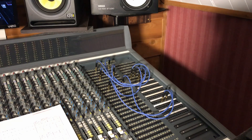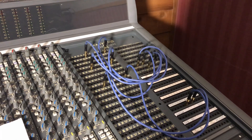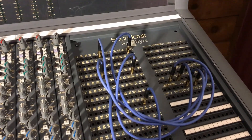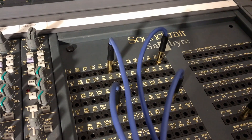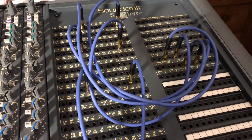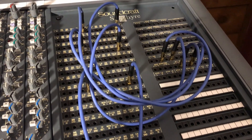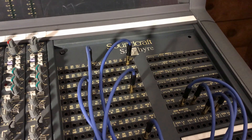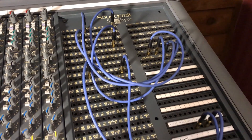A key part of what makes it easy to do videos and bypass all other equipment — to give an honest representation of what a particular piece of gear sounds like — is this patch bay. I have the ins and outs to my interfaces set up like a tape machine. The Echo Audio Fire 12s work like a tape machine in input mode, so whatever is going into channel two, for example, is going to come out the output of channel two while idling.